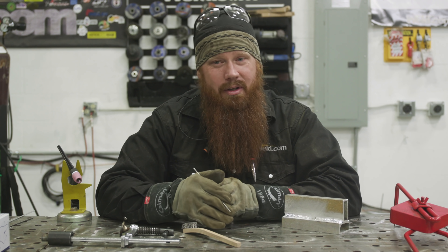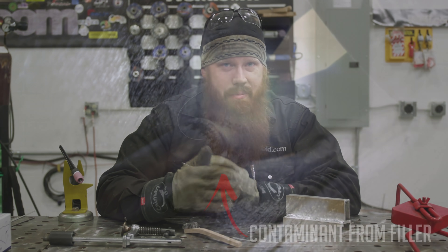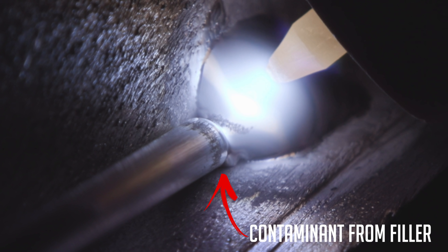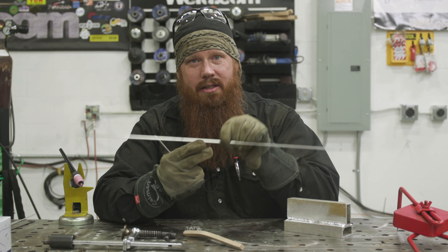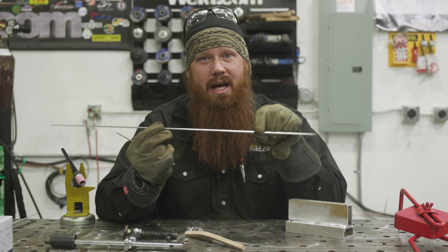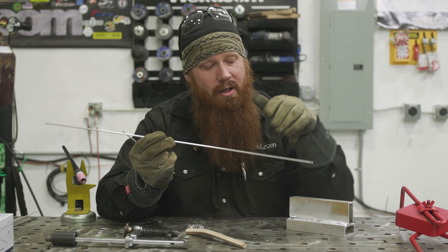As always, you're going to want to clean your filler metal before you go in there. I know a lot of people think it's wasting too much time, and for most repair work or certain fabrication you're not going to bother — but if you clean up your filler metal your results are going to be a lot better. You have to think about it: aluminum oxide is naturally going to form on your filler metal just as it does on the base metal you're working on. Hopefully you found the video educational and informative.